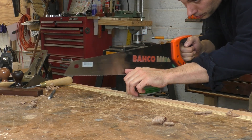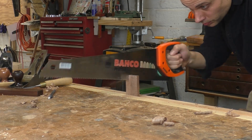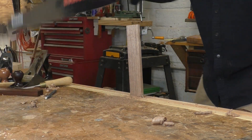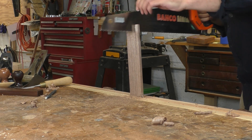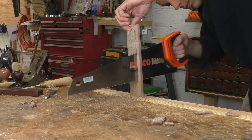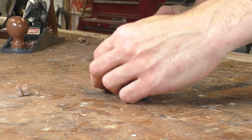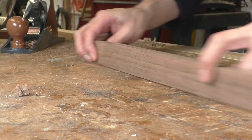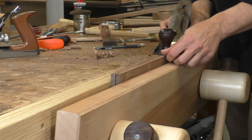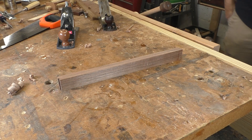I'm using this Bahco saw — I'll do a complete review next month, but I really like it. This saw works out of the box with no tuning, it's inexpensive, and it's resharpenable. I will link to it in the description. When I move the work up in the vise, there's a lot of danger from vibration and splitting, so I just take my free hand and pull gently toward myself as I cut. My arm absorbs that vibration, and I can work faster because I have more of the wood sticking out of the vise. After you plane off the worst of the saw marks, place your beams with the reference edges down on a clean part of the bench. Once they're lined up, all the inaccuracies will be along that top edge. Once you've planed it parallel to the reference edge, your beams are finished — at this point you have a pair of perfectly functional winding sticks.